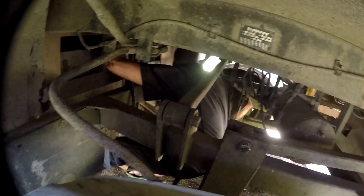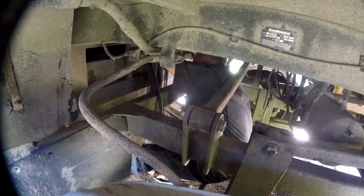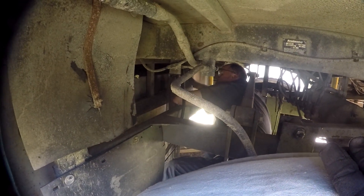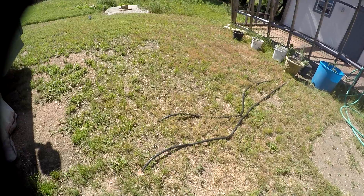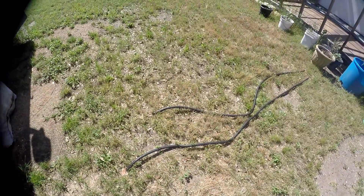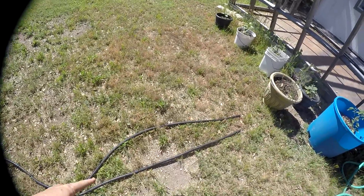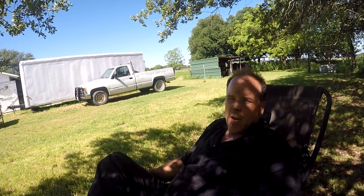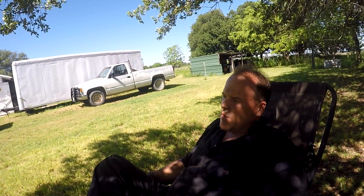The hydraulic pressure line has metal braiding on the inside, so we had to use the grinder with a cutting wheel to get through it. We took the lines back as far as we could — there's a front bulkhead — and cut them off there so they'll be easier to pull through the tunnel passageway. Now going in the back to find them and pull them from the back out.